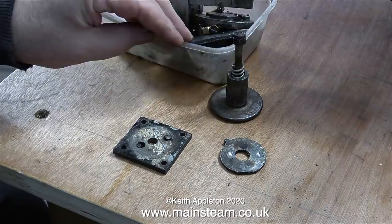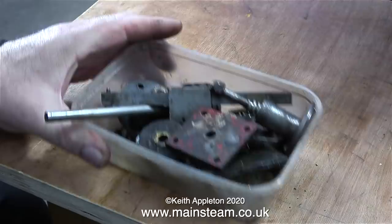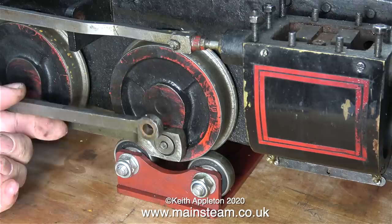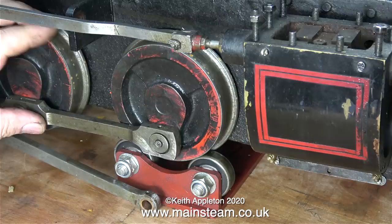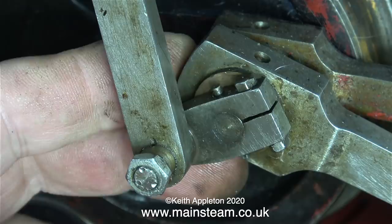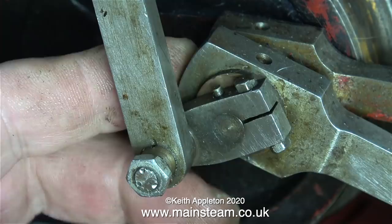I want to put the buffer stock parts in the box along with the other parts that were already there. The connecting rod is tied up with a piece of tubing — I'm untying that for the moment. With the connecting rod free to slide on the bench, I can rotate the wheels. To comment that there's a bit of slop in the coupling rod would be a major understatement, and the slight wear in the big end is quite evident too. Here it is magnified. This is not bad workmanship — most of the parts seem to be quite well made. This is just wear and tear.